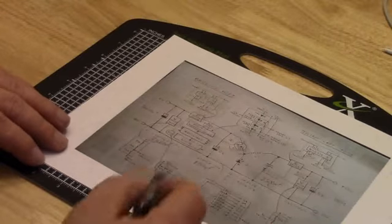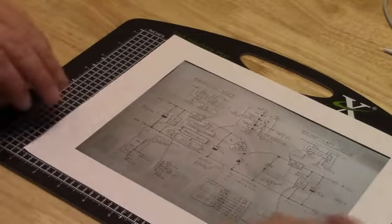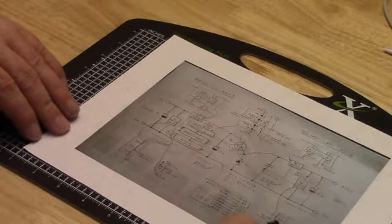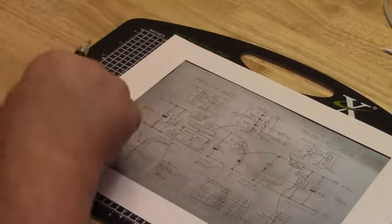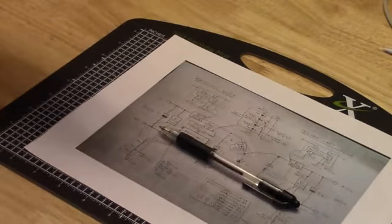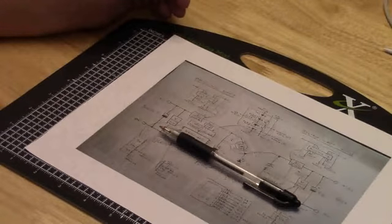I won't be using the Nokia 5110 display like he did. I'm just going to use a straight 4-line 20 character display. And my current design is all of the displaying will be done by a second Arduino. The reason is, I want to take basically this circuit with some changes and future changes, because there's some other ideas I got, to make a mirror image, right? At present, I'm thinking about changing that too. You have one Arduino sitting between both those lines, and you got a mirror version. This will be phased, this will be anti-phased. And all the voltages get merged down at the end on the board going out to the batteries.